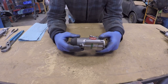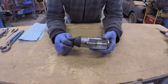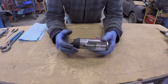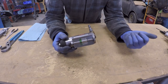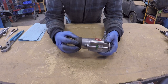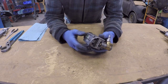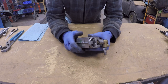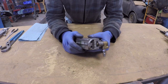The butterfly gun is similar in that it has an air vane motor. The ways it is different: it has an impact drive, so it is not coupled to your tool with a planetary drive or directly — it goes through an impact system. The other difference is that instead of reversing the tool using a mechanical device after the motor, we reverse the motor itself. In this tool we have a paddle on it and there are two valves instead of one.